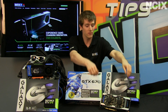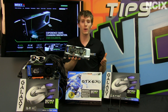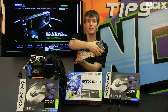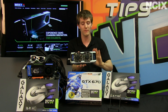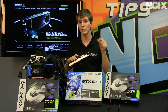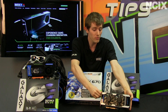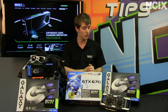At launch, the GTX 670 was already available with a wide variety of aftermarket solutions, including factory overclocked reference cards from the likes of MSI, as well as completely non-reference boards from the likes of Galaxy. That card uses dual 92mm fans, an upgraded PCB with 6-plus-8-pin power — whereas the standard card only has two 6-pin connectors — as well as a glowing logo. Some of these factory overclocked cards are pretty close to a GTX 680 in terms of performance.